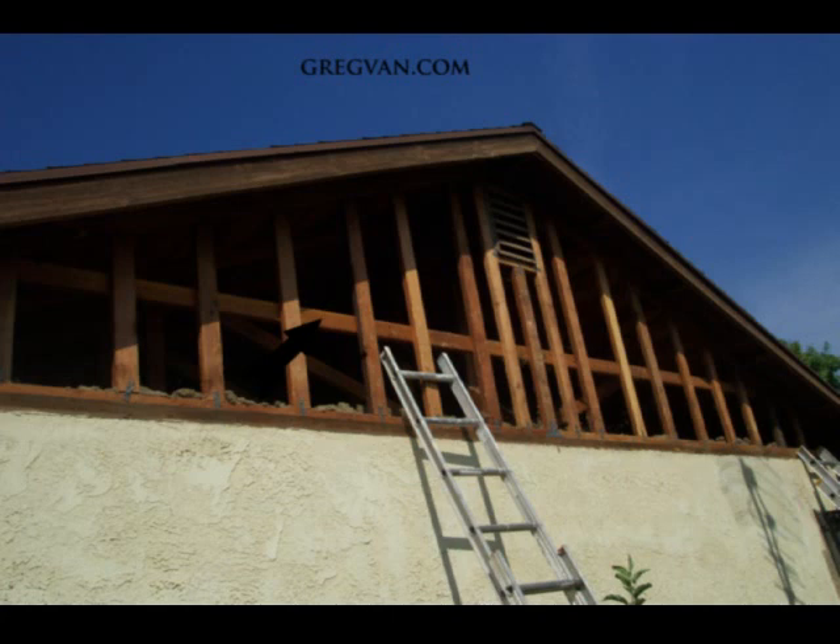Here's a quick tip for home builders. If you run into a situation where you have a flat studded gable truss like this one and the studs are not turned the other way — if these studs were turned at a 90 degree angle like the wall studs used to frame the wall underneath, in the same direction, then you wouldn't need to nail a strong back on.